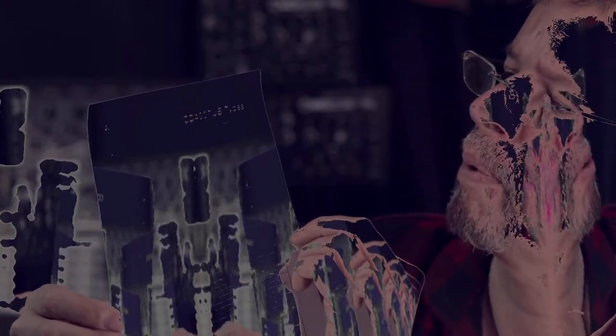The way that we sort stuff like that out is printing out the data sheets. Granted, that's maybe not the most helpful data sheet right now, because you can not even slightly read that, but if you could, it would say CD4007UB, which is a dual complementary pair plus inverter, so it's like transistors. And we'll step through this stuff.